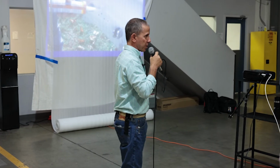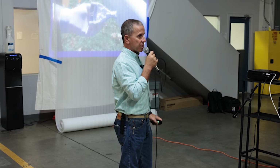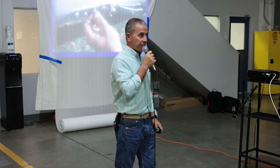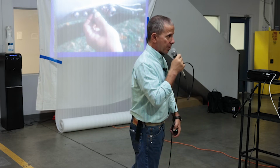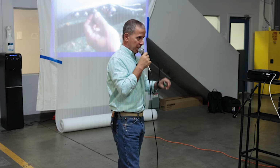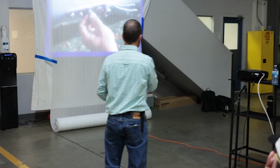Obviously the fasteners also need to be bedded individually. So that step that's being installed on that painted aluminum mast, lots and lots of bedding material there to get full squeeze out. And as the fasteners are being put in, the fasteners should be bedded as well. And if there's a water leakage issue, if it's going into a cabin structure or below the water line, we need to seal those threads as well. But from a paint perspective, we want 100% contact between the bedding material and the flange.